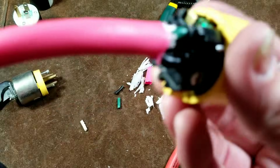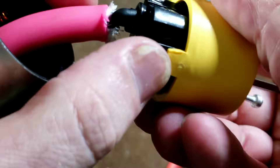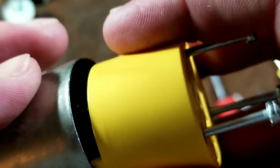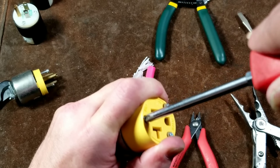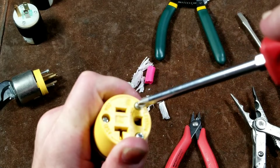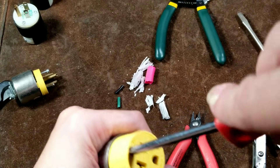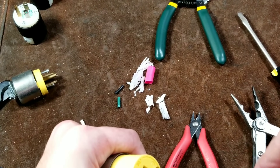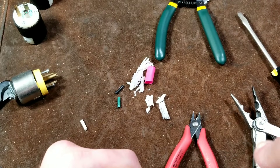Now let's get that shell. What's interesting is there's a little copper-plated spring that presses against a little tab right there — that's how it grounds the shell. There's also a little notch here, and you want to pay attention to that. A lot of cord ends do have an orientation; there's a little slot that it fits in so you know you're getting it correct. It just sits in there like that. Then we'll take and tighten down these three screws — you don't want to torque these too much, but you want to make sure they're in there good and tight.